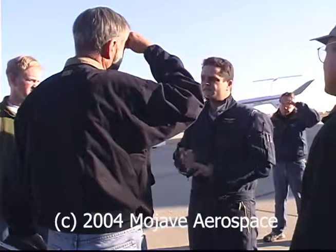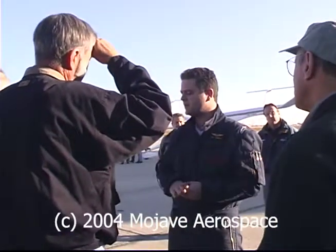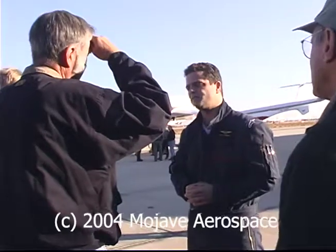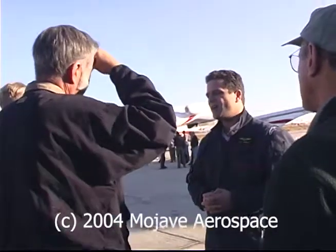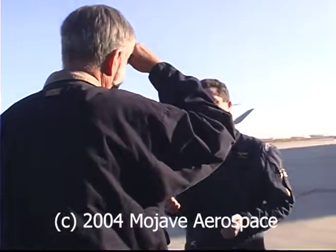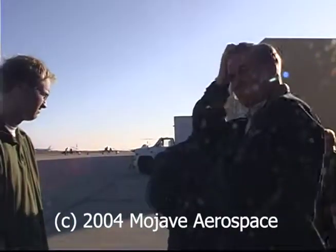This was at the high altitude. And it did not feel like a separation. Mid altitude. All of the side slips really had that same general tendency. But real easy, you know, rudder feels nice. I don't think it's snatchy, but there is that roll coupling which sort of confuses the issue when you put the roll in to counter the side slip. I don't know if it's the roll or the rudder that's doing that. It's hard to tell.